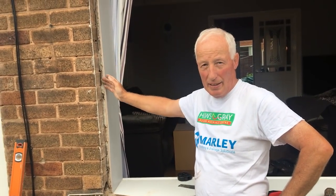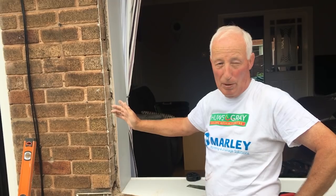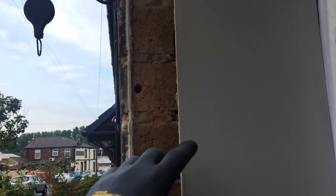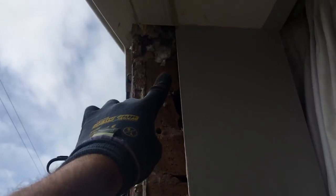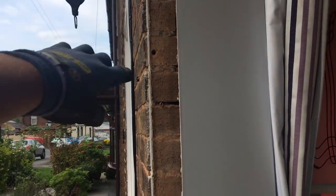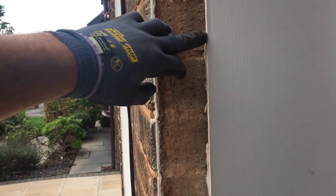So what are you going to do about that, KC? What I'm going to do is put the plaster line back, level it all up, and then put it in plumb — do it proper, as you should. We're going to make a pencil line from nothing to about 20mm at the bottom, and that'll counteract everything to make a plumb plaster reveal.